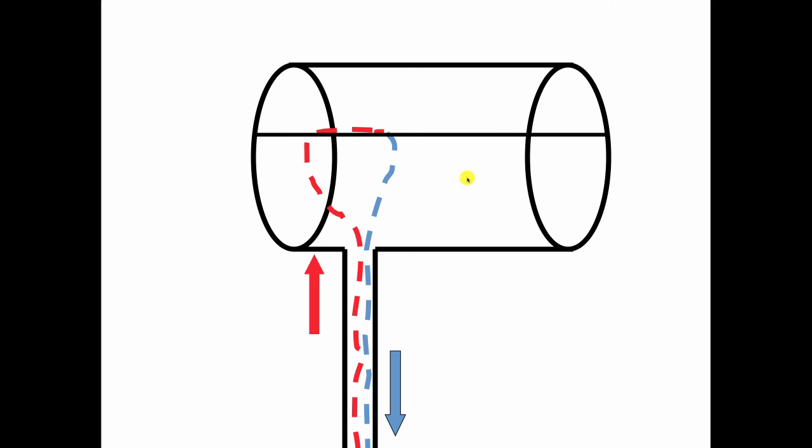Since we're not pumping through it, the water in the tank is going to be cooler than the water in the system. So when you get this kind of gravity circulation naturally happening here, the air that's in the cushion gets absorbed into the tank water because of Henry's Law. And that cooler water, which has air dissolved in it, is going to come down into the system, and it's going to join the flow of the hot water going out, and it's going to wind up coming out of solution and be in a radiator somewhere.